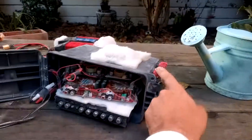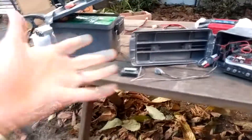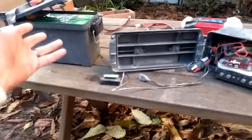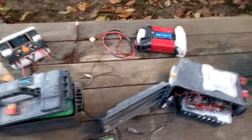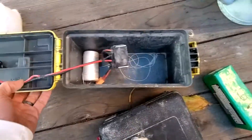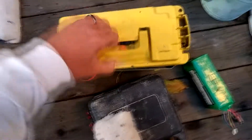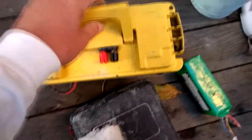You can drive whatever speakers you want off these. I also have yet another ammo can with a buck converter that goes from battery voltage — about 15 volts — down to a flat 12 volts, so I can run anything. There's a car cigarette lighter adapter so people can plug in any 12-volt device. Some things care about voltage — like LED strips will fry on 15 volts. Charging takes about an hour and a half, and you can do two packs simultaneously. Inside that box there's a 10-amp buck converter; output goes to banana jacks, up to about 10 amps.